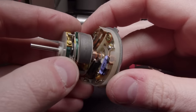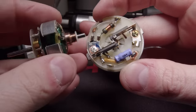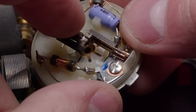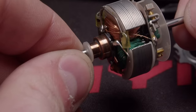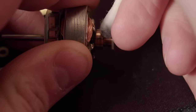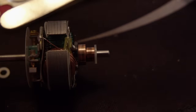We're still taking the motor apart. It's actually a brushed motor, which makes sense. Little small DC brushless motors - I don't think those were a thing back then. Those brushes look fairly worn - maybe, I don't know. The commutator's not too dirty, but I am cleaning it off - some of that carbon buildup - with just some isopropyl alcohol and a Q-tip.